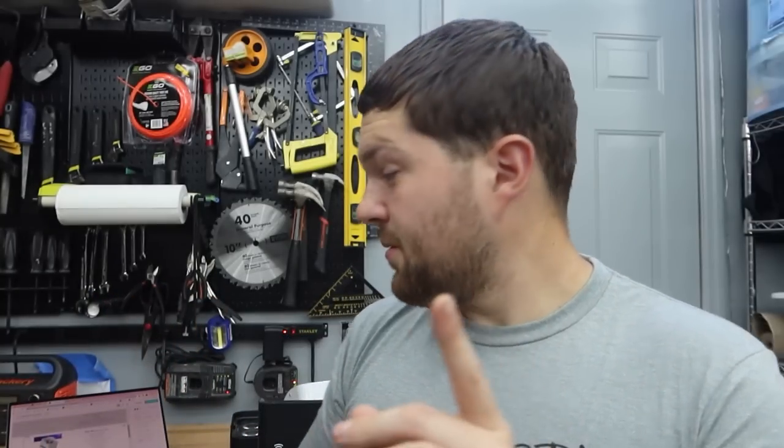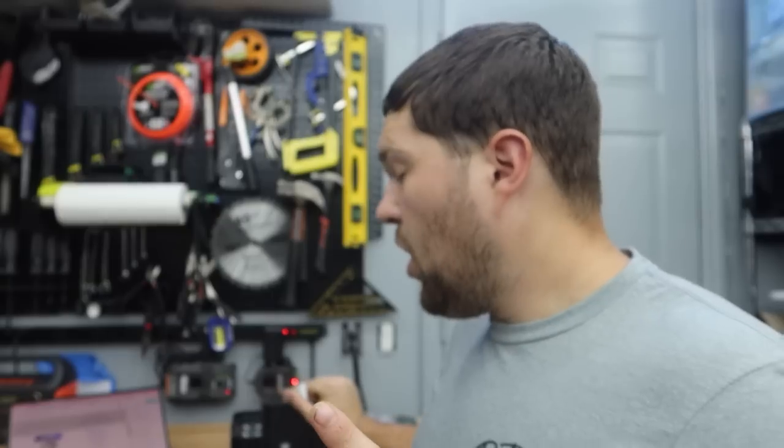So the next test, we wanted to see something more realistic. And what we did was we turned on 3 faders to make a pink. It's kind of the worst case color I could think that you would want to make, a hot pink, where you're combining red, blue, and UV. So all 3 of those faders on max. What we found out, S6s came in about 6.9 hours of battery life, just shy of 7 hours. The S4s though, these guys right here, almost always made it to 8 hours or a little bit past 8 hours. So we're talking a little over an hour of difference of battery in that case.